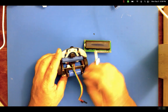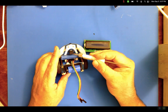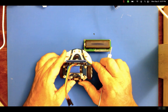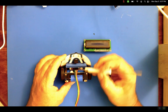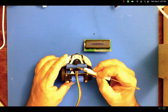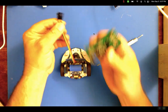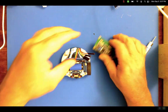If you don't want to plug it in there, you can actually plug it in here. This second row, where it says IIC, see that? It says IIC there on the second row. That follows the same pinout as here. So this is ground. This is voltage. This is pin 19, and this is pin 20. So you've got to make sure you plug them in correctly. They are not aligned to just go like that for some reason.